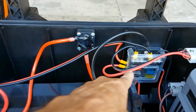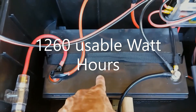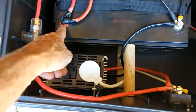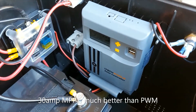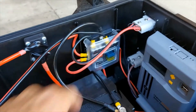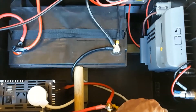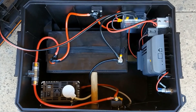I've got a long wire going from the 12-volt fuse box over to the lid so I can take the lid off and get to it easily. There's my 120-amp-hour lithium battery, and a 600-watt pure sine wave inverter wired through the on-off switch, going through a 60-amp inline fuse to the battery. The other wire goes to the 12-volt on-off switch and then to the fuse panel. The solar controller is wired to the bottom Anderson plug, and the top Anderson plug goes straight to the fuse box with the 30-amp fuse. There's also extra space for extension leads, adapters, and plenty of room to mount a mains charger if you wanted.